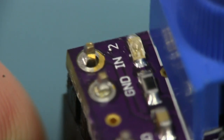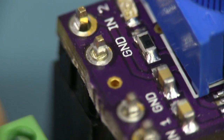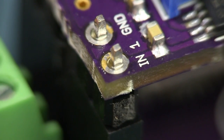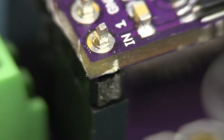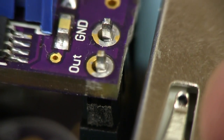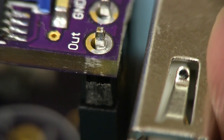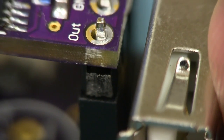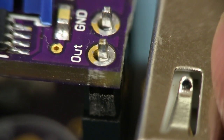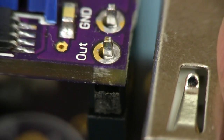And the next thing is the solder. So you haven't used nearly enough solder there. I do applaud your use of minimalist solder. Too much solder looks really ugly, but you really haven't used enough there at all. Always use fine solder, of course. I believe you have been using fine solder, like I use, 0.4 or 0.35 millimeter diameter solder, really thin stuff, but then feed it on there until you get a nice fillet on all of those joints.